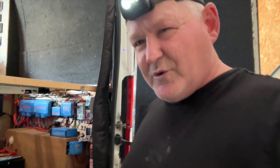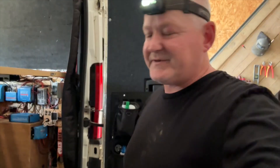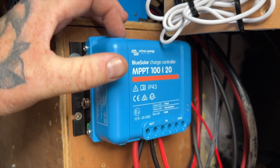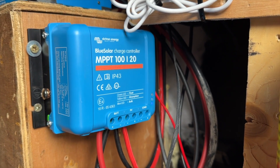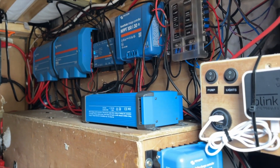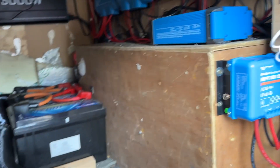I've been really busy with my electrics. I've tidied up and shortened some cables, though I've run out of lugs so more cable management is still needed. The Cerbo is working and everything is running. All I need now is my new lithium battery — a 460-amp Fogstar battery. This little device is a BlueSolar, not a SmartSolar, so I can't Bluetooth and check it — I'm going to order a Blue SmartSolar, so this one is for sale if anyone wants it. I'm getting an extra two amps at the moment, but it proves that my whole electrical system works: the two Lynx Power-Ins converted to distributors, two MPPTs, electric hookup, Victron XS DC-to-DC, and 3000-watt inverter.